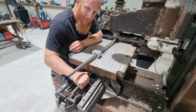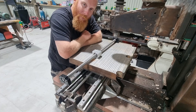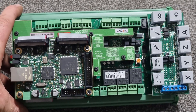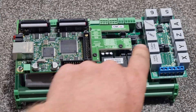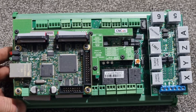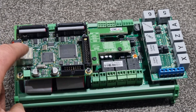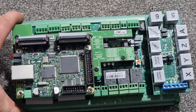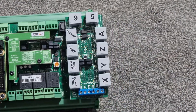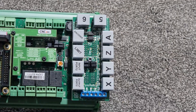With the 16mm ones I was running little NEMA 23 motors and they were having a hard time pushing the plate around. This board here is the C82 CNC controller board from CNC for PC. I talked to Arturo down there and he was really helpful — he sorted me out with pretty much everything I needed. This control board runs an Ethernet smooth stepper board on top, and the two outputs here feed the rest of the board. It's actually a six-axis board with an encoder and all the limit switches — it's a really good board.